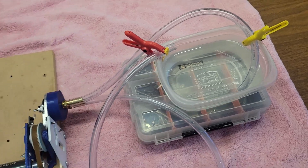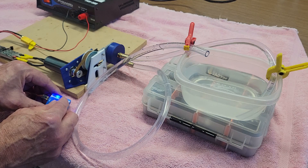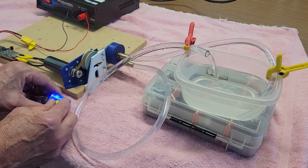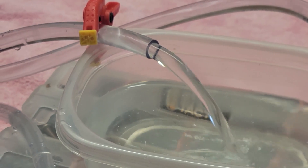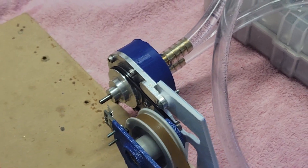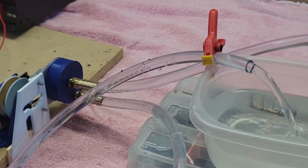So let's see how this thing works. There we have it — the water pump for our Wallaby 30cc engine. I was actually pretty surprised how well it works. I had some reservations about using plastic for the body of the water pump, but I think it's going to work fine. This PET-G that I use is a high temperature plastic, much higher than the temperature of the water, and it's pretty well isolated from the body of the engine. So we'll see how that works out. Until next time, I'm Greg. Thanks for visiting me and my machine shop. Take care.